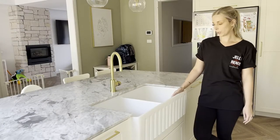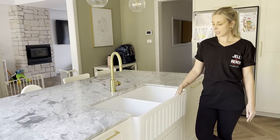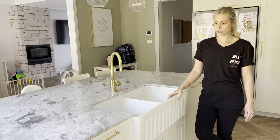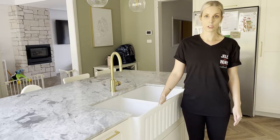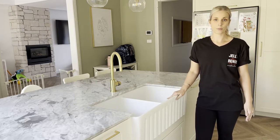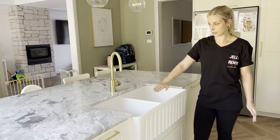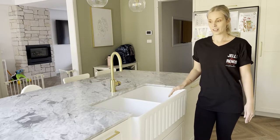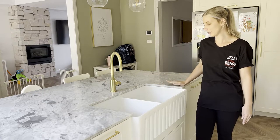Just for your plumber or whoever is installing it — these sinks are made from ceramic, so when they're put in a kiln they actually change shape. They're never going to be perfect in terms of the measurements stated on the website. You really do need to wait until you have the sink in your hands before you can plan how you're going to cut it into your bench space. Definitely wait to get your sink before you start cutting out your marble, wood, or whatever you're using as your bench top.